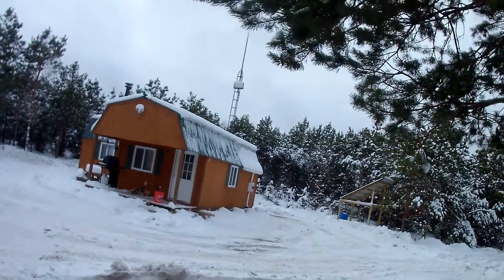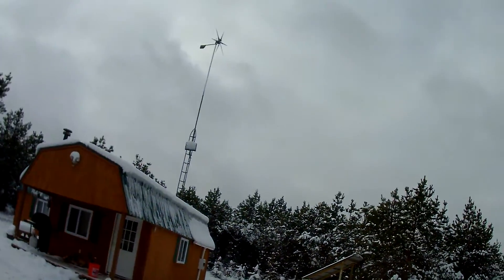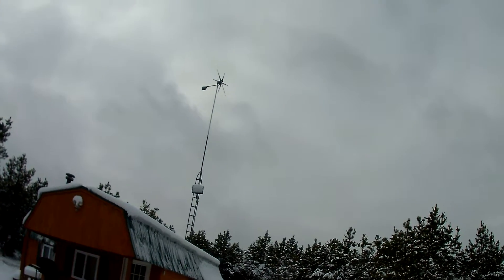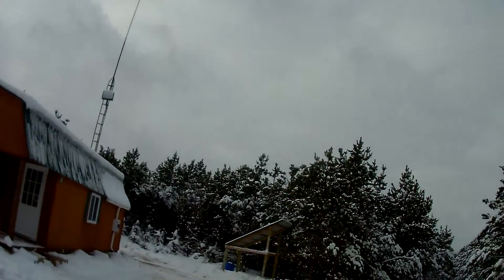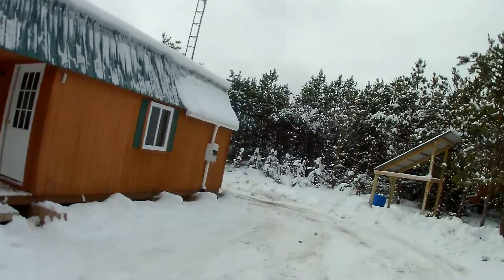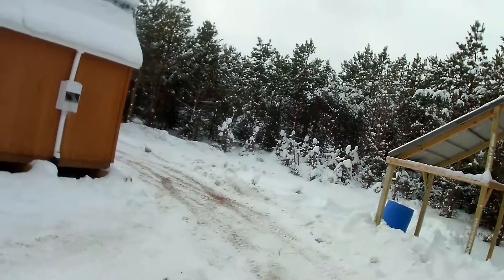That's the cabin there. Got a 500-watt windmill — I have to get back to you on that. It claims to be 500 watts, but we had 15 mile-an-hour winds this weekend and I measured 24 watts. Not very impressive. It's one of those with the Delco alternator and the carbon blades, supposed to be all awesome. I think there's something wrong with it.